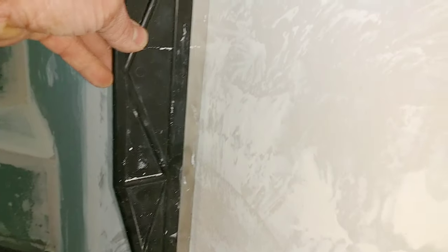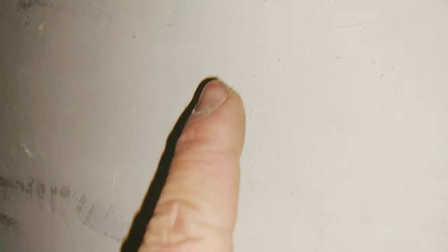As of right now I skim coated all the texture to kind of get rid of it. There was some baseboard that this clown put up here to use as crown molding but it looked like trash. We ended up removing the caulking right there — it takes off some of the paint with it usually, so you skim coat over that and then you can't see anything later. The biggest issue is we have some discrepancies — this is supposed to be a flat wall. You can see that we sanded it down to the point that some of the little fuzz is coming up from the tape, but there's still high spots on the tape and low spots everywhere else. So we're going to go and skim those out, build up the low spots so that we can have this hopefully as smooth as possible.